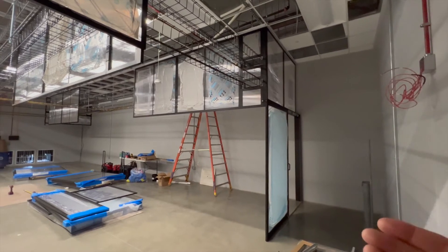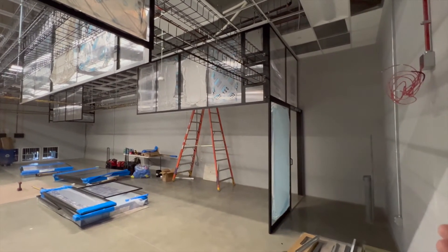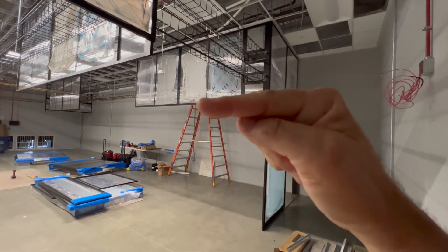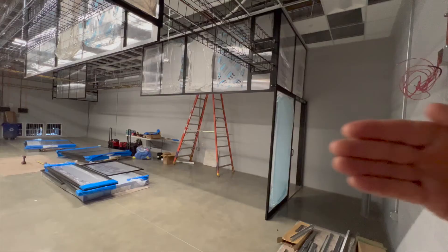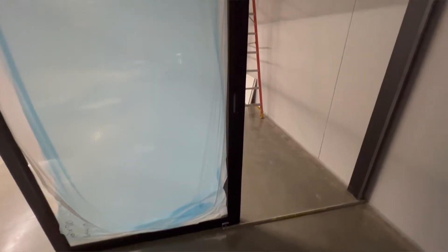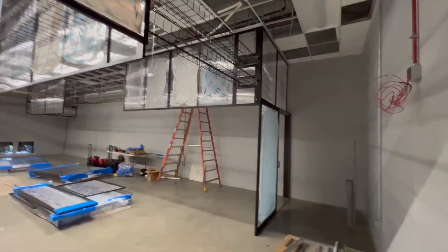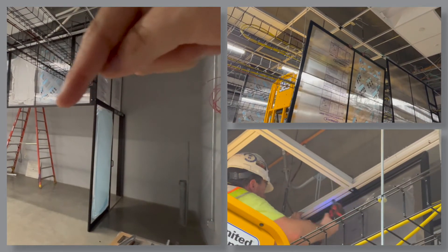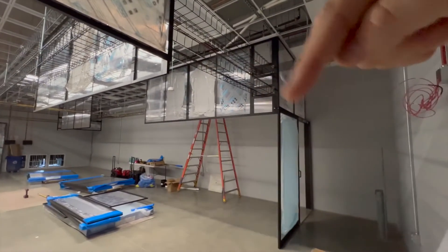The hot aisle containment barriers are being installed in this data hall. These are also called HACs. They drop from the Dynamax grid and come down to the top of the racks, which hold the data systems, computers, and everything. It forms a tunnel that you enter through sliding doors manufactured by Sub-Zero as well. At the other end, there's also another set of sliding doors that let you out into the opposite hallway. These HACs attach to the Dynamax and hang down, integrating with the top of the racks. We actually have two of these tunnels in this particular data hall.